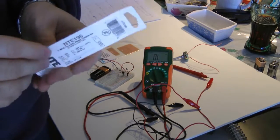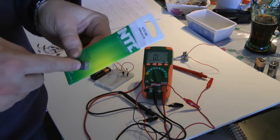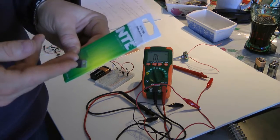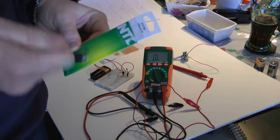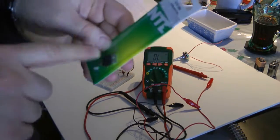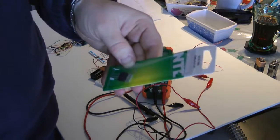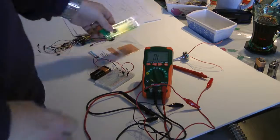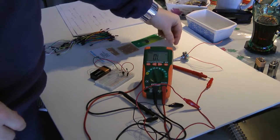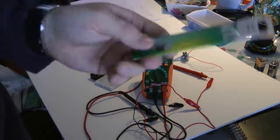What I didn't mention earlier is what thermal paste does. When you put metal to metal, there are a lot of gaps that you don't see. The thermal paste creates a better, tighter bond between the heat sink and whatever metal you're using to pull the heat away. So it creates a better bond between those two. Another NPN. Okay, so Jerry, you have something that's creating a short.